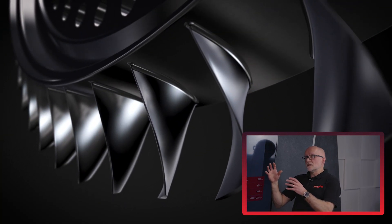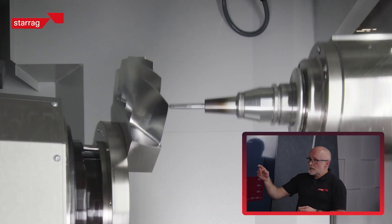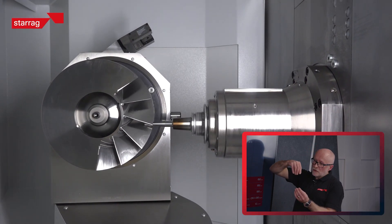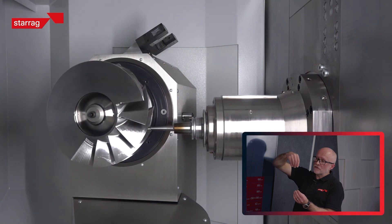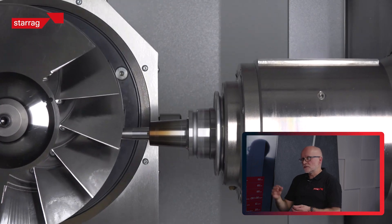Very much like an aerofoil turbine blade, you have an aerofoil profile that has to be measured along the length of the blade around the full five-axis profile. In terms of the whole profile, tolerance depends on the blisk but you're talking just a few microns, and that is in order to give you the most efficient and reliable engine. So there you have it — another episode in the series talking about aerospace components and aerospace machining, and this one has been all about blisks.